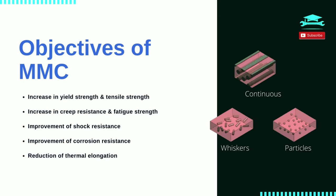So why does the science world focus on MMCs? MMC is the fabricated material usually designed for specific applications, with enhanced desired properties such as in automobiles — for example, a higher yield strength and tensile strength like required for a conrod, or a higher wear resistance such as in brake rotors. In general, the solidification synthesis of metal matrix composites involves melting of the selected matrix material, followed by the introduction of a reinforcement material into the melt, obtaining a suitable dispersion. A desired improvement in physical, mechanical or tribological behaviour is usually answered by a metal matrix composite and has various applications.